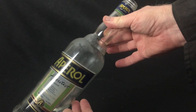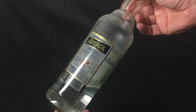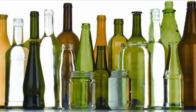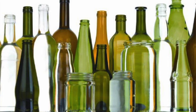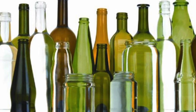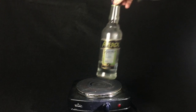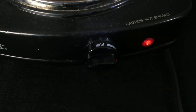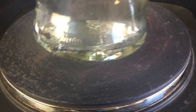It would be a lot cheaper and easier if you could use any discarded bottle like this one that you can get for the asking from almost any bar in the world. The problem for the Citizen Scientist on a budget is that common glassware like this doesn't stand up well to strong heating. That's because, like almost every material on earth, glass expands as it warms. So if you were to set this bottle on an electric burner and turn up the heat, the bottom will warm and therefore try to expand faster than the sides, creating a stress inside the material that ultimately cracks the glass.